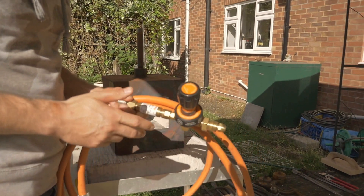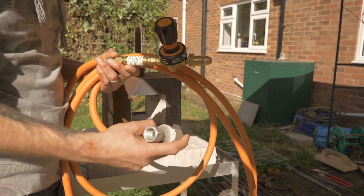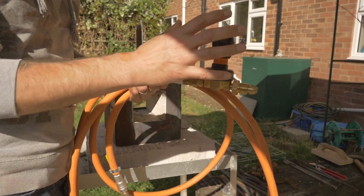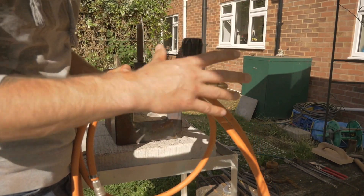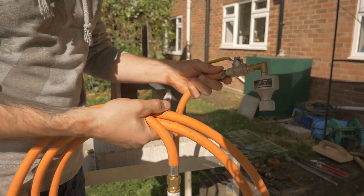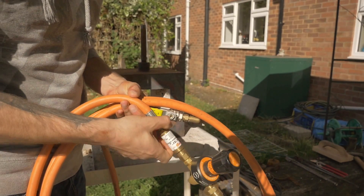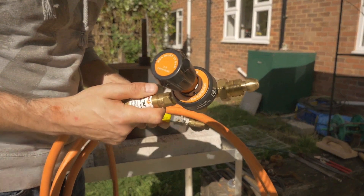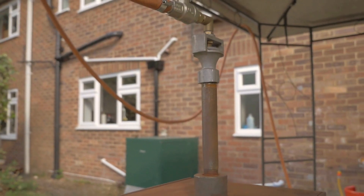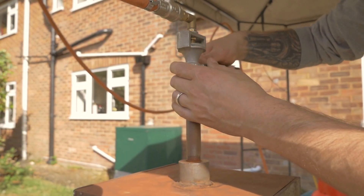The next thing to add onto the forge is the various pipework. There are jets that you need to connect to the burner. I'm no expert here, but I do know you need an arrester to protect yourself from the gas bottle. You have to connect up the top bit onto the top of the burner. You have a control mechanism here to allow the gas through, and the other end goes onto your propane tank. As you can see I've now connected the top onto the burner and just need to tighten this up to make sure it's nice and secure.